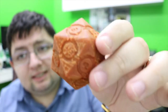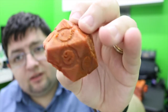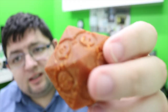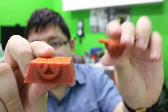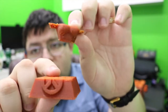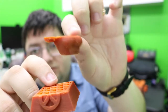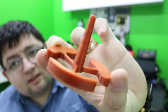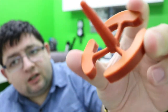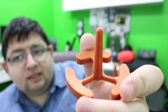Then I tried something new with the settings. I put high detail — it wasted a whole night. I made a bigger version of the die, it was really, really crappy. This one came out better — the Overwatch Mercy came out. The stand, the podium, coming out fine. Mercy herself, not that fine. And this came out perfect. Basically I lowered the speed from 100 to 60, and a couple other settings. And that's it.